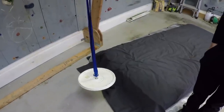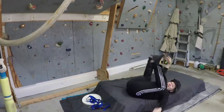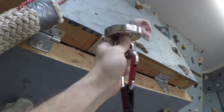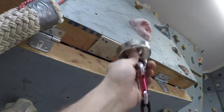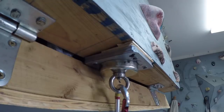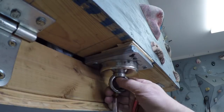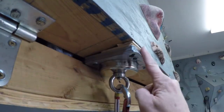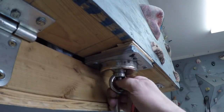127.5 pounds. Did I get a 350 pound force neodymium magnet? This one doesn't qualify based on the test we just ran. I was getting ready to wrap up the video and quite frankly was very disappointed because the magnet was failing — it was supposed to be a 350 pound magnet. So I went back and looked at the specs on how they tested it, and they tested it not with one sheet of steel but the equivalent of half an inch of steel.